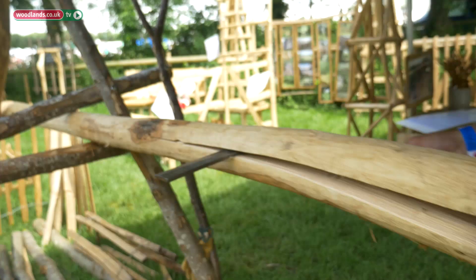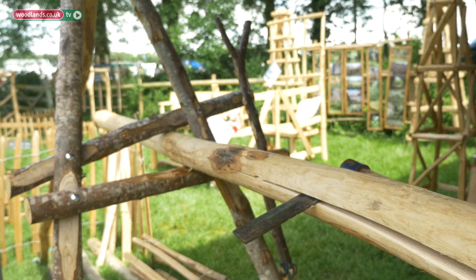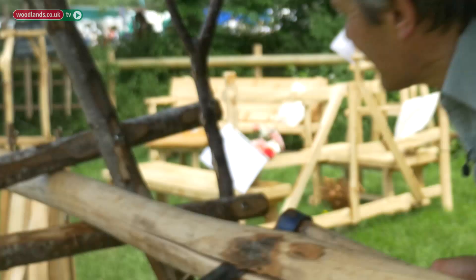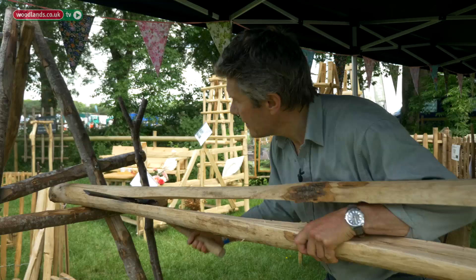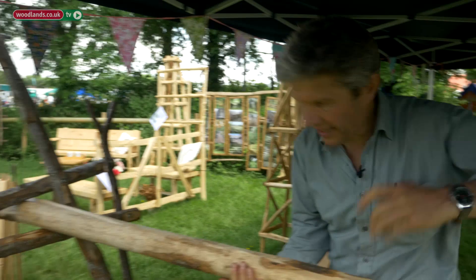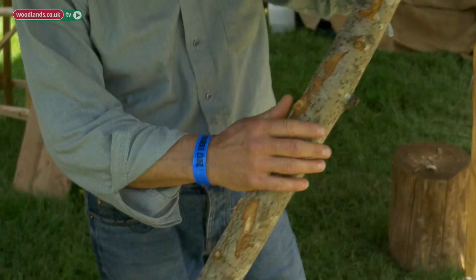What's happening is it's tending to split off up to the top. So what we do is turn it over, fat side down, push it forward a bit. We can then apply pressure on this lower timber and that will hopefully correct the split so it starts to go back down. Not the cleanest of splits I've done. I always take the bark off chestnut — it can encourage wood boring insects, bark borer beetle, which isn't going to do anything structural to the timber, it's more cosmetic.